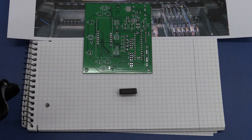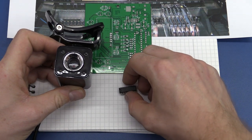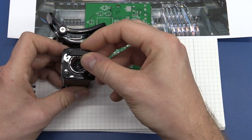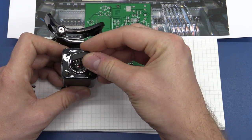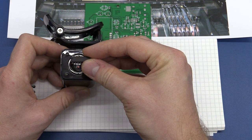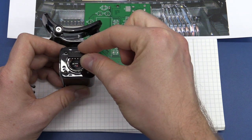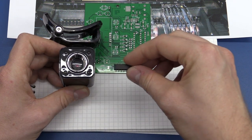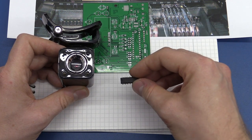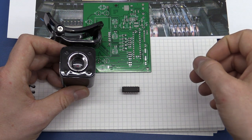So the way I plan to solve that is to have a camera mounted in the bed of the machine. So when we pick up the component, we move it over here. We use some computer vision to track the edges of the part, and then that can give us an angle that we need to correct it to get it straight. Also, it can find the edges and make us put the component in the center of the view here to zero it out, so we can put it straight down on the pads and it's not shifted to any side. I reckon this is what takes the most of the work. The rest of it is quite simple.